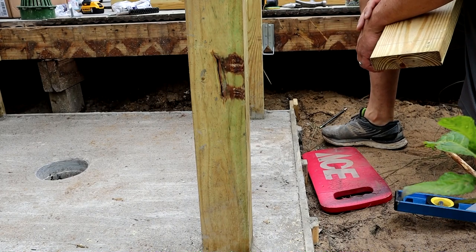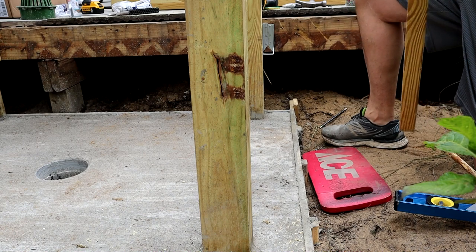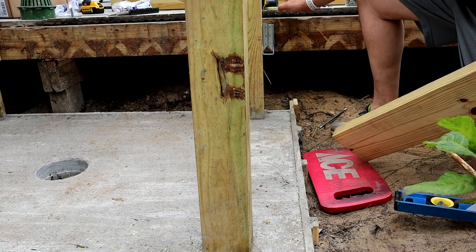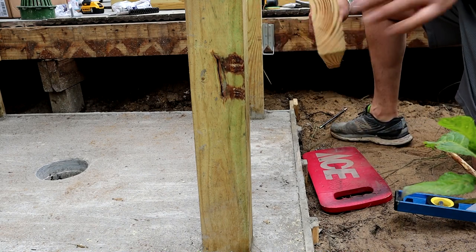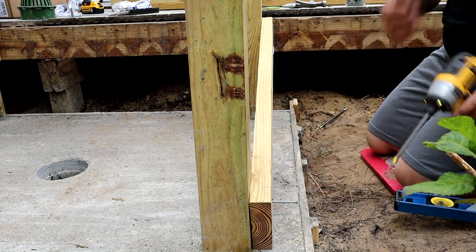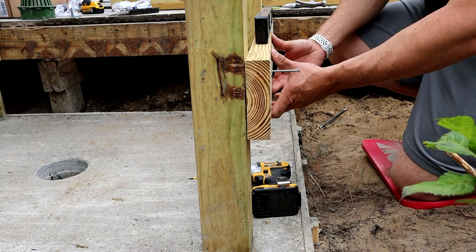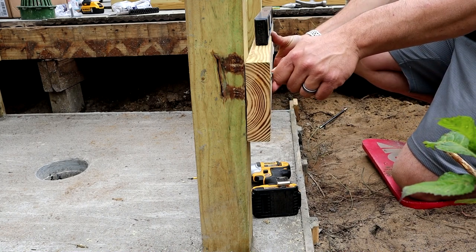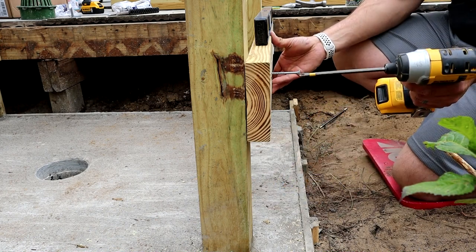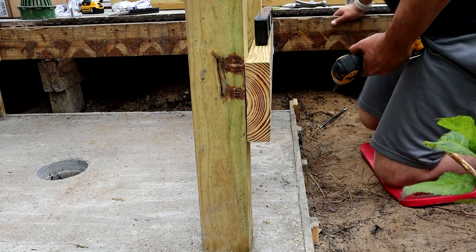It's the next day - I decided to take the rest of yesterday off because the kids wanted to go out and I didn't have the hardware, and I wasn't waiting in line for ages at Home Depot. Got my six inch carriage bolts so we can get this done this morning. Off camera I took the rim joist off and added a joist hanger to tie it a little better into the existing deck. I had to take about a sixteenth of an inch off the end to line it back up on the edge. I ended up going to Lowe's, and they just let you walk in freely - no waiting outside - which was fantastic.